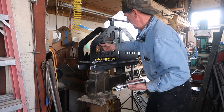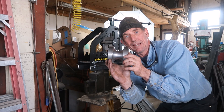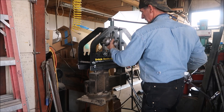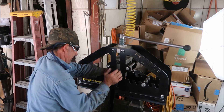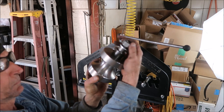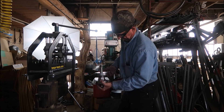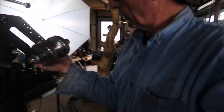We've got a couple of axles. We'll start with a two-inch die, just like we've been doing over there with that other bender. It's a two-inch die designed for tubing - outside diameter right there. We've got a drive handle, and the drive wheel has a keyway cut into it - you see it there? The handle's got the keyway cut right on top of it too. These dies are going to be a lot easier to change out when we're ready to go to a different profile - they just drop right in the slots.